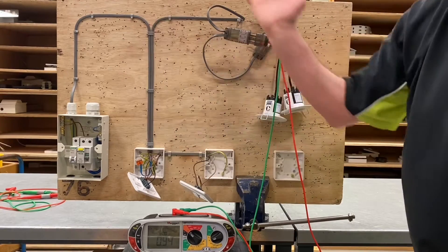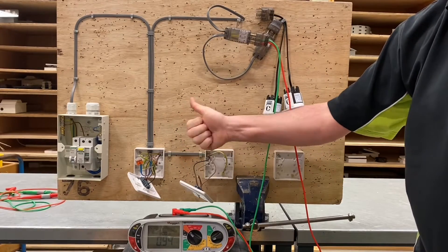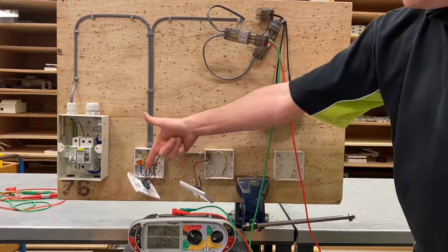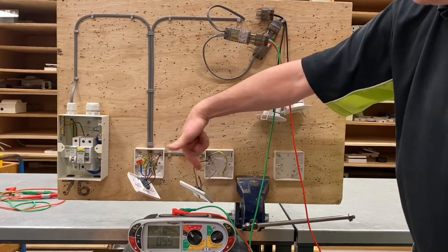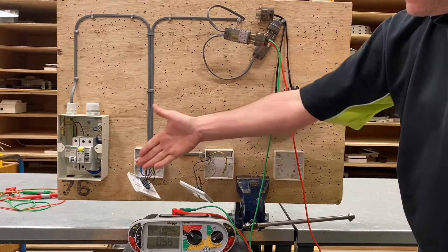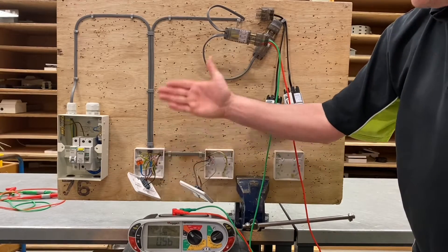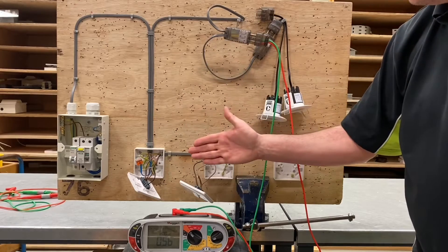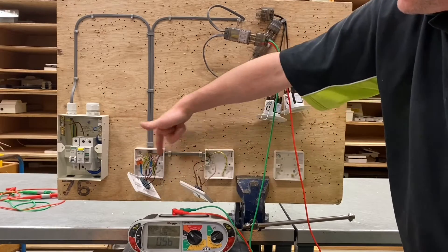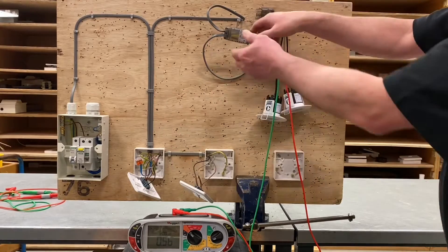For those who are observant: the switches at college very rarely have current and voltage passing through them, so there's no spark to clean the contacts when opening and closing. These switches are often left in boxes for a year before reuse, so readings keep changing. I tell learners to go through the switching sequence a few times first so the switch contacts have been made and broken, then pick a reading. The reading settles down to a lower value, but it's the highest reading through the sequence that we must record.